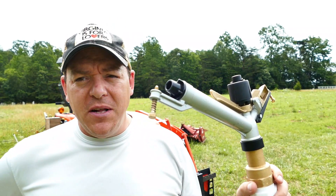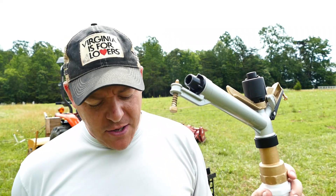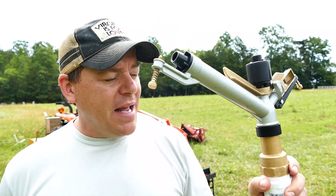Yesterday I was out here and I filmed a video for Woods Tree Farm, which is my other channel in case you didn't know that. The short story of that video was that my old trash pump, which doesn't put out high pressure, was able to shoot a single one of these sprinklers out about 48 feet. And the new pump will now shoot it out up to about 70 feet. So now that I know the new pump generates higher pressure and does a much better job handling these big sprinklers, I want to see how it can handle two of them. So let's get to work.